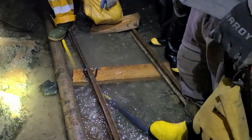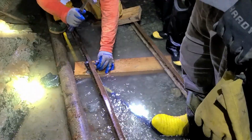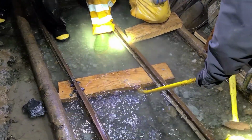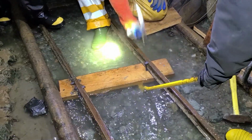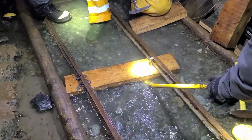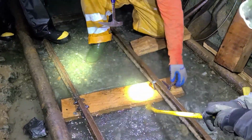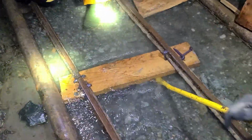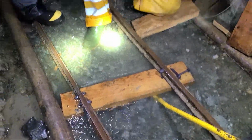You see my angle? Yeah. I angle it in a little bit so, you know, hopefully I miss that. And so when we are doing rail work, this is typically the way you do it. You would do one on the inside and two on your outsides. It's not as important on the straight stretch, but on the corner, you want to make sure you get two on your outsides always, because the weight is going to be on that corner, you know?